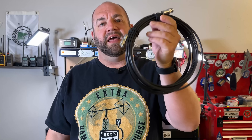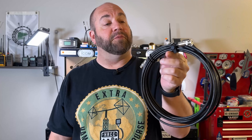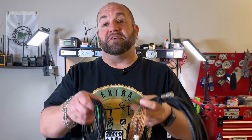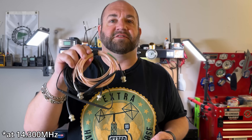A few months ago, I was talking with Stefano Messi, and he sent me this. This is their Airborne 5, an extremely lightweight yet efficient coaxial cable. This 30-foot run weighs 0.2 kilograms, which is less than half a pound — about the same weight as this 35-foot run of RG174 and this 25-foot run of RG316, while being three times as efficient as the RG174 and about twice as efficient as the RG316.